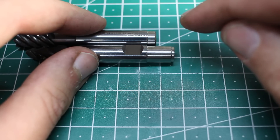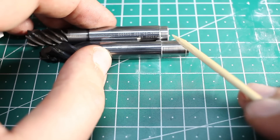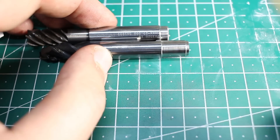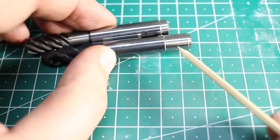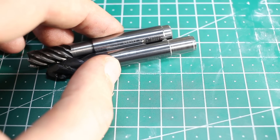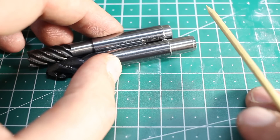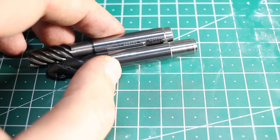If you go on the internet and look up Kern, the common knowledge is that you use diamond or diamond coated tooling on carbide, because it's harder than the carbide. But CBN — cubic boron nitride — is also harder than carbide. It's way softer than diamond, but it's still harder than carbide. To be honest, I didn't believe you could machine carbide that way. I even wrote on a German forum that CBN is too soft to cut carbide. But then somebody proved me wrong — he showed a shank of carbide and was able to make some scratches into it with a CBN insert.